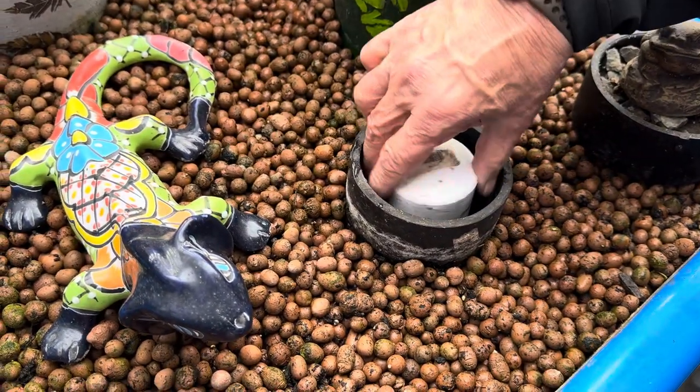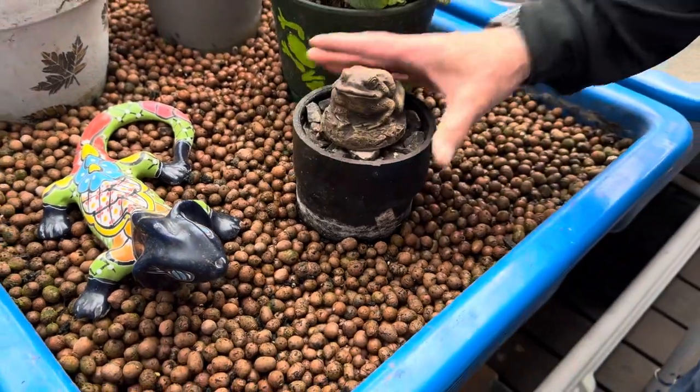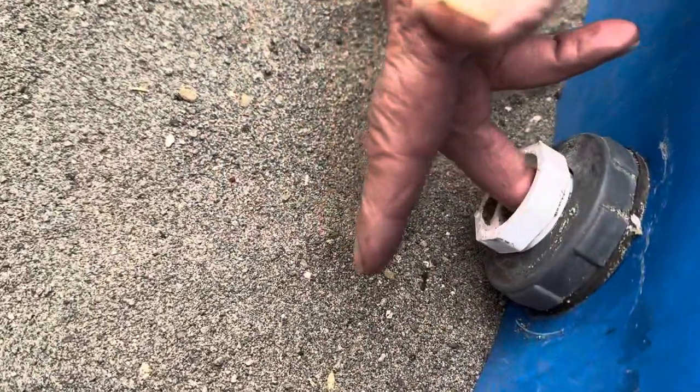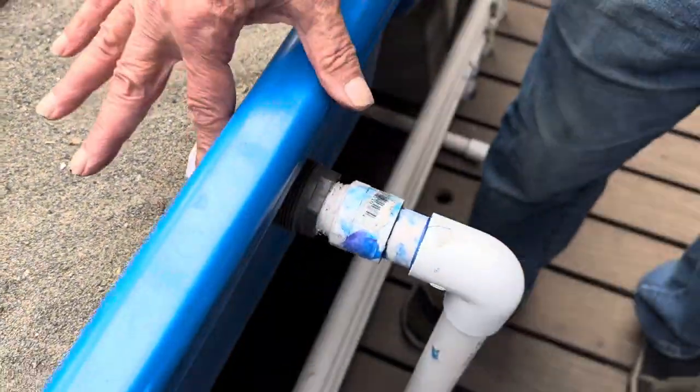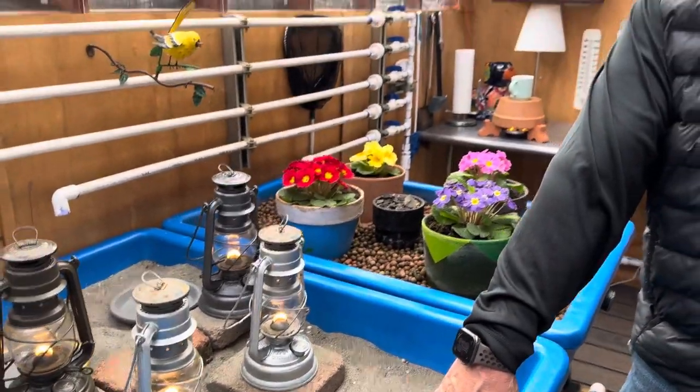At the bottom of this is what they call a bulkhead fitting. And you can see one right here that goes through the, so this has got a plug in it, is why it's here, but basically it lets you have liquid go through a wall like that. This is a Schedule 80 bulkhead fitting. If you're gonna buy bulkhead fittings, get Schedule 80, not Schedule 40. You'll be sorry if you don't. They have much better surface for making them not leak.